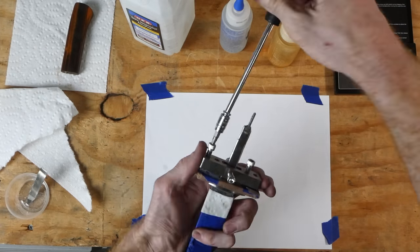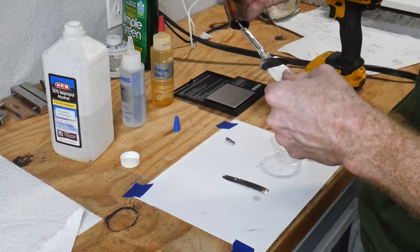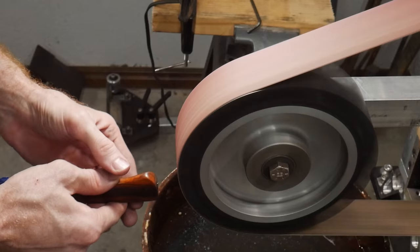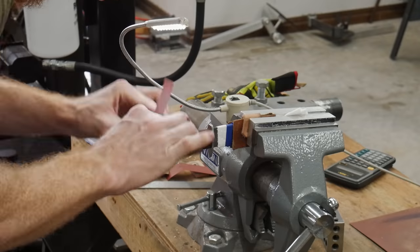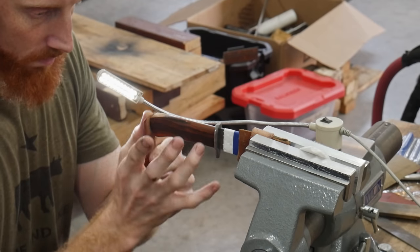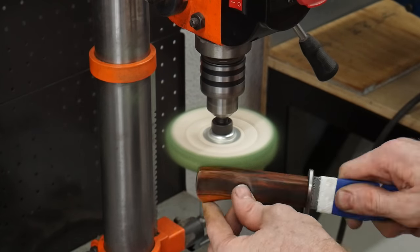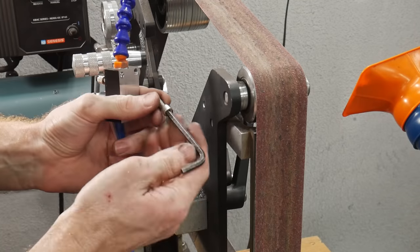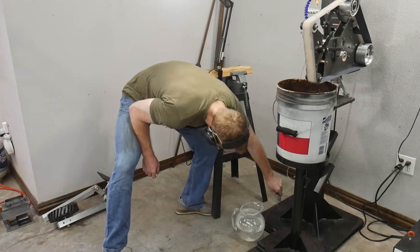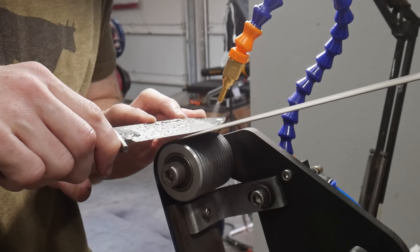I put a little epoxy on the back end of the guard and used the guard jack to press it into the shoulder — and this is the point where I messed up. I didn't line up the guard in the up-and-down direction properly and actually glued it a little too low on the ricasso. This brought the entire handle down because the handle has alignment pins in it, so the issue cascaded all the way up to the rear being at the wrong angle — the handle no longer lined up with the ricasso. I mention all these mistakes not to be hard on the knife, but to point out spots that can go wrong so maybe you don't make those same mistakes on your own builds.